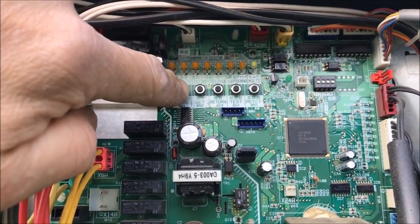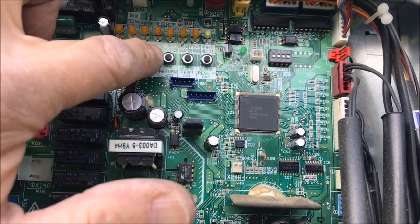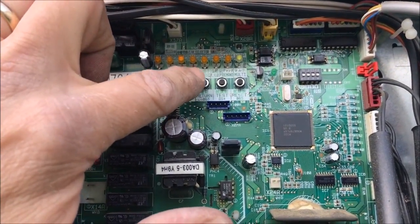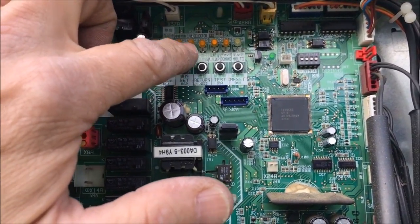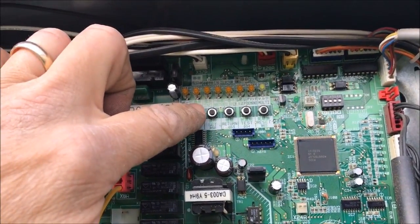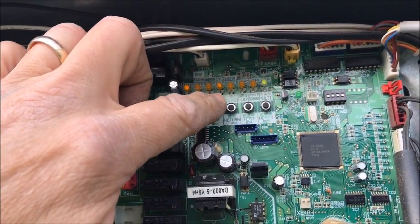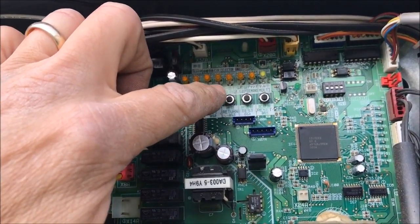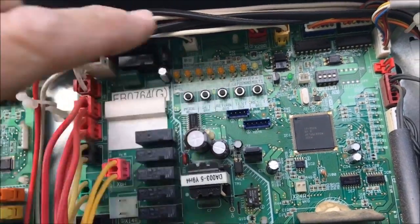So I'm going to go ahead and release the other compressor. So I just go into monitor mode 2 again, 39 times. Now I will go out of there and I will go in again just to verify, and I'll do 38 times and I'll lock this side out. She's off. This side's gonna run now.